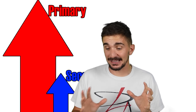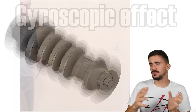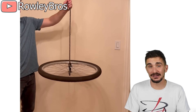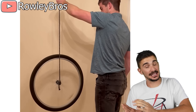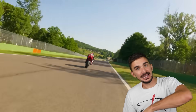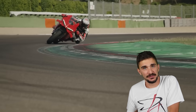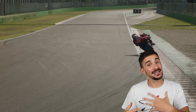So the square four in terms of balance is just like the inline four — not really, because the square four has a little trick up its sleeve. Whenever you spin a crankshaft at very high speed, you create a gyroscopic effect. Think of a bicycle or motorcycle wheel spinning at high speed — such a wheel tends to resist being tipped sideways; it wants to remain stable. In a motorcycle, the high-speed rotation of the crankshaft similarly tends to resist being tipped sideways, making the motorcycle harder to lean and requiring more effort to change direction, which means the bike is less agile.